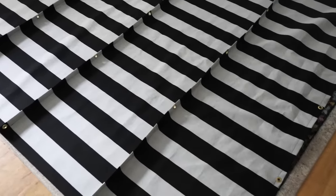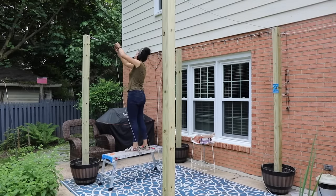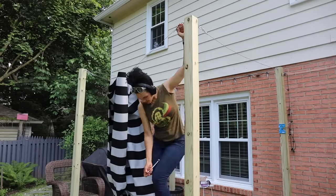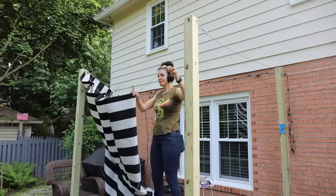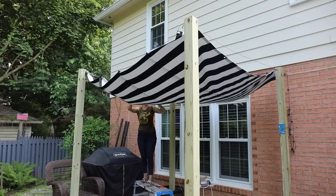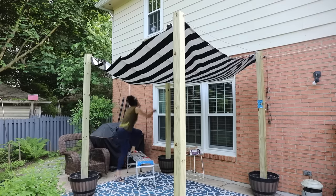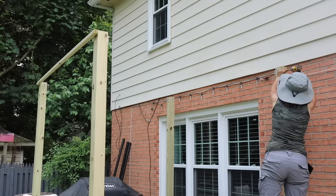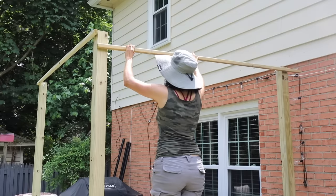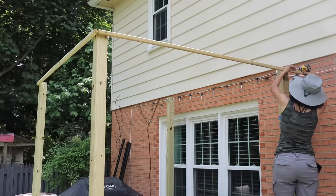This was designed thinking I was going to use wire ropes, but it didn't go as planned. As I started putting the sunshade onto the ropes I realized the weight of the fabric was a lot heavier than I expected. It started pulling the wire ropes down and it just didn't look good — it wasn't functioning the way I had hoped and there was no way for it to be retractable. At that point I needed to redesign the top so it wasn't just one big piece hanging down in the center. I took everything apart and decided to get some two by two pressure-treated boards and attach all four by four posts to create a canopy with more structure.